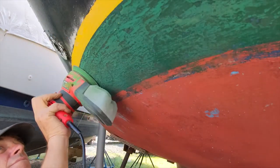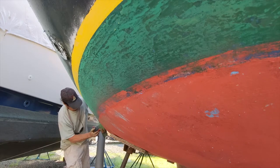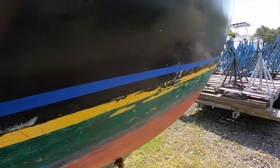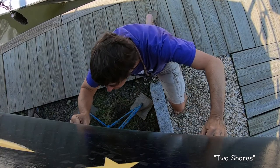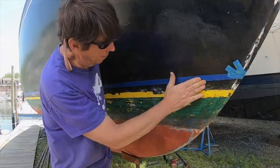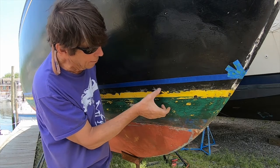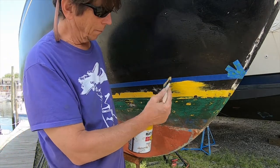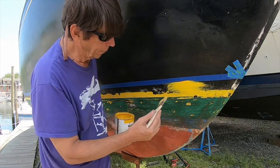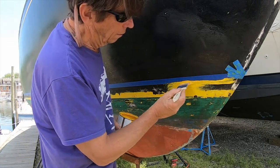Getting the strut back in was going to be a two-man job and I had a friend coming, but he was a bit late. So while I waited, I entertained myself with working on the boot top stripes. More stuff in the boat means heavier boat means boat lower in the water. You can see how much higher I'm going to go, but I was getting a lot of growth on the bottom green stripe here, so I've just got to raise it all up. And what I'm going to do is not worry about the bottom edge — kind of overpaint it and then put the tape off the green on top instead of taping twice. Lazy or clever — you decide.